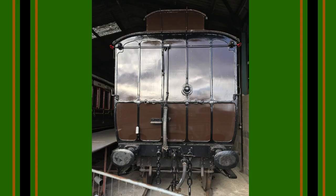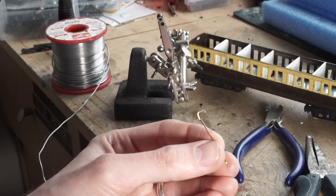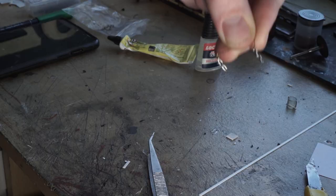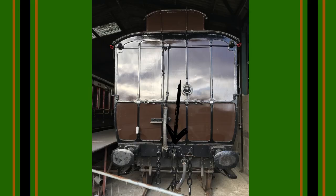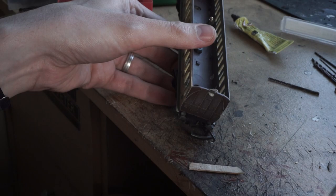Next we're moving to the ends of the coaches. I took a photo at Didcot which shows a conduit and rodding, so I'm attempting to make that out of brass rod and plastic card. We also have the vacuum hoses, being made partially from brass rod and partially from guitar string. At this time, the two chains are also being glued into position. I don't have any spare three-link couplings at the moment so no hook will have to do for now. Lastly, I filled the hole where the roof clips in, as I'll just glue the roof in place at the end to improve the look of the ends.